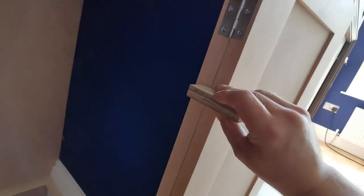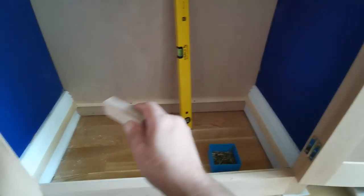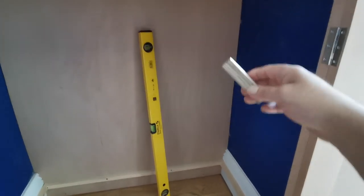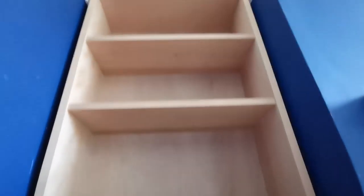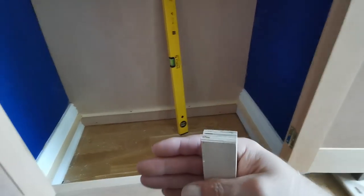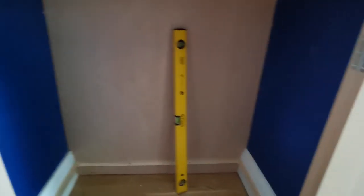I've done that and that worked out. What I need to do now is come down the thickness of the top — whatever that is — level it round, put some more battens on like this, then I can get my ply in. Normally I struggle a little bit and have to take a batten off to be able to get the ply in, but I think what I'm going to end up doing is taking all this down anyway. Take the top off, and once the battens are on I can take the front off and slide the ply in, scribe it to get it as close as I can to the shape of this.